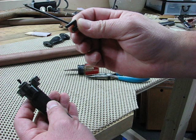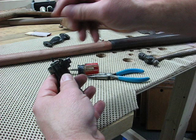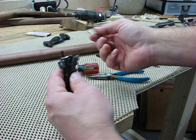Slide your firing pin back in, and use your pinky to hold it in place or you'll be disassembling and reassembling when it falls out. Put this down — it's going to end up here on this indentation. I'm telling you, it has to go in this direction. It's the biggest thing people don't understand, so do not push your extractor in, just lay it in there. This is floating.